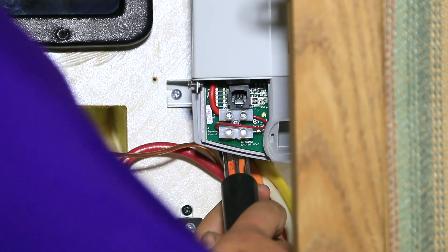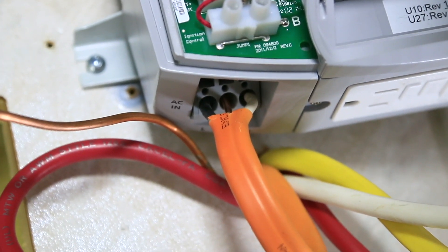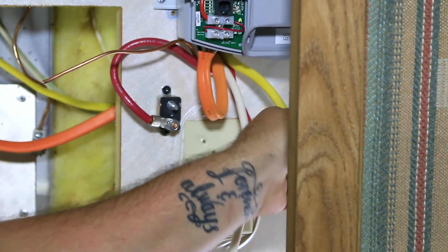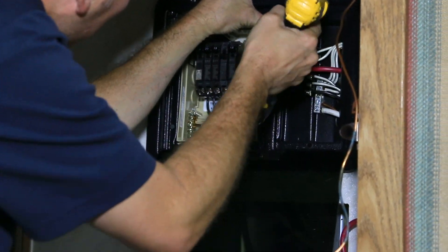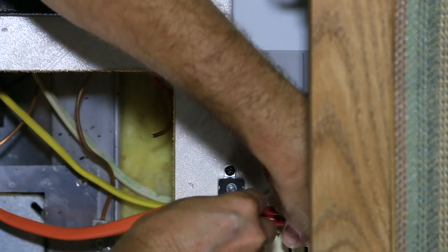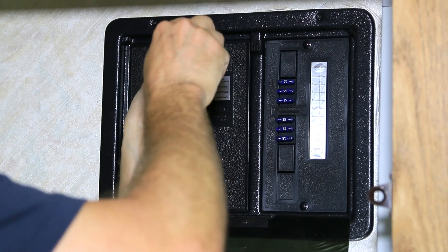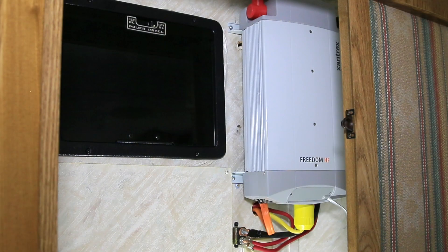As you can see here on the left side, we have the orange 10-gauge Romex coming in. And on the right-hand side in the yellow Romex, we've added a simple three-prong plug to plug into the GFI outlet coming off the inverter, making the installation that much more simple. Reattaching the AC-DC panel back into the wall. In this step, we're making sure we have a good earth ground so the GFI on the output for this inverter will operate correctly. Once we have completed all of our contacts, we tuck our wires back in the panel and reinstall the front cover.